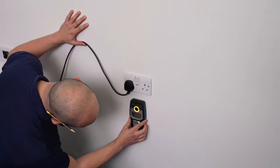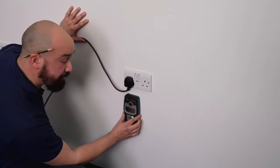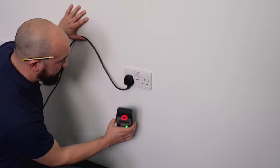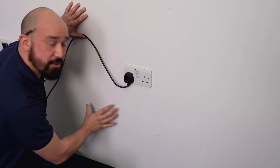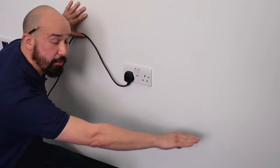And there we go. You might not be able to see on the screen there, but that is rough. That's now telling me that this is dead center. Okay, so pretty good guess that there's a live wire here. Number of scans left and right, and you can then dial it down, but I'm pretty confident it's coming down. It's probably running along the bottom there.